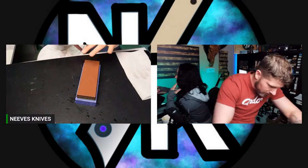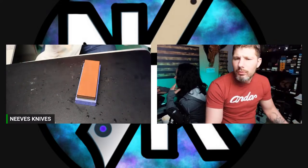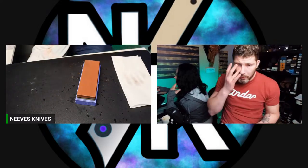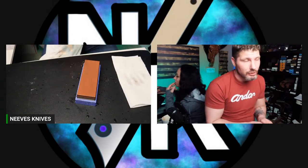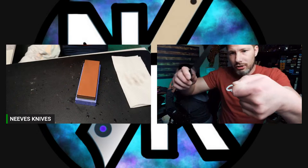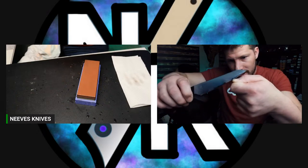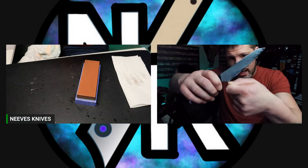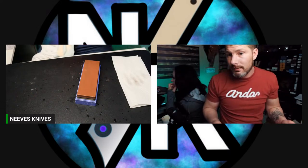Is there a tip to be sure that the entire edge is burr-free? There's two tricks. One, you take your nail, you go like this, and it should feel like glass. You should feel no nicks, chips, or anything. Like right now, I feel a couple little tiny spots that tells me I'm not done.